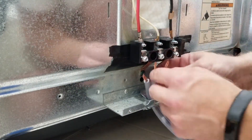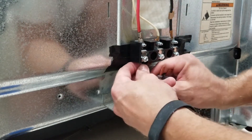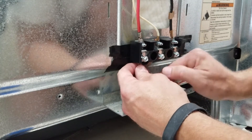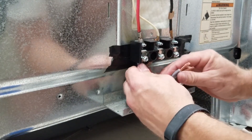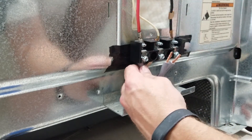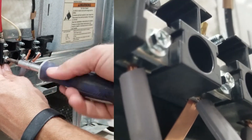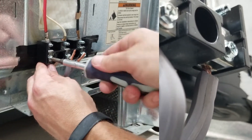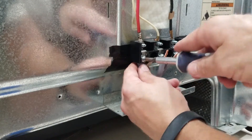Make sure all the screws are backed all the way out. You'll have to kind of pinch the wire a little bit and feed it inside the terminal. Be careful you're not just crushing it or pushing the strands back — you want all the strands to actually go inside the terminal. I found the easiest way is to put one wire in at a time and tighten it down so you're not fighting the rest of the cable.